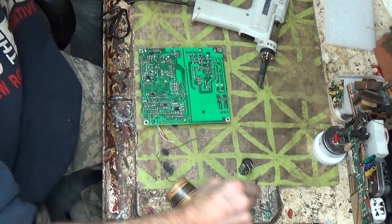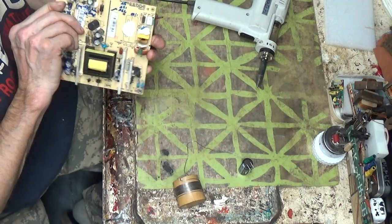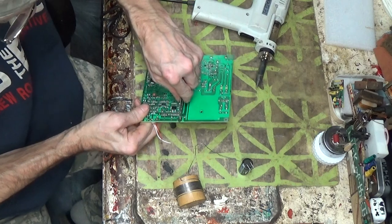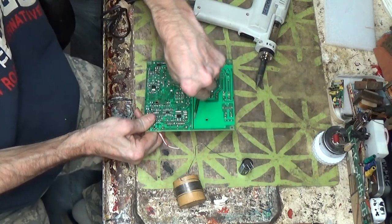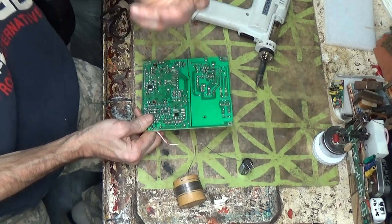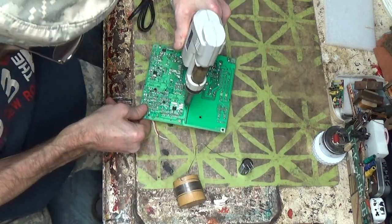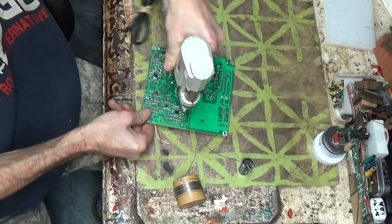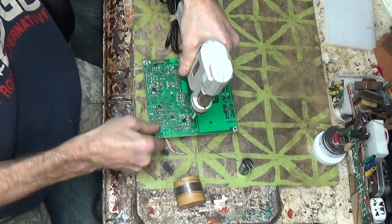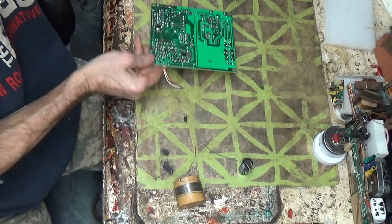Quite a bit of the time, like when you're doing a bunch of pins in a row for a DIP, a dual inline package, anything like that, what happens is every other few of them, you'll get one that'll stick. It'll be pushed to one side, and when you come off of it, it'll be stuck. But you'll never know that when you're trying to pull it out. You figure if it don't fall out, it's hard to tell what pin's loose or not. But that's what happens, you'll have one stuck. See, it just whoop, pop down, and I give it a round the world, we could call it.